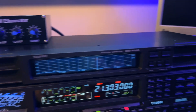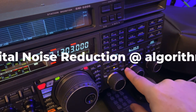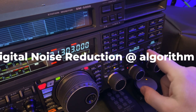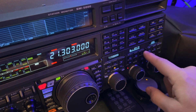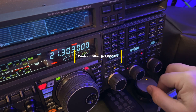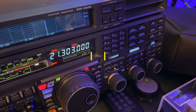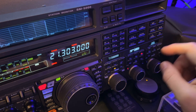Over here on DSP — I already had my digital noise reduction engaged. It was at four. Could have probably run it up a little bit. Then — Contour. Boy, Contour is your friend. I wound up at 2,000 hertz. I start there and go plus or minus. A lot of times, 1,900 or 2,200 are the sweet spots, but I had him good at 2,000.